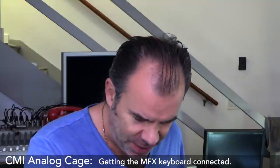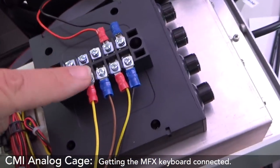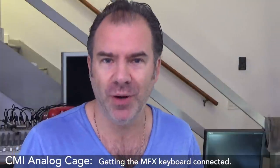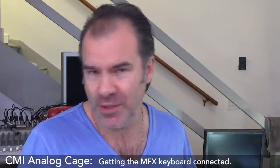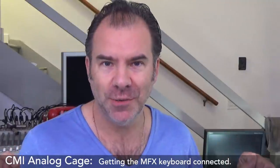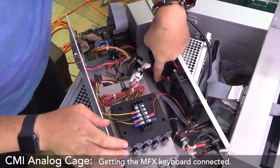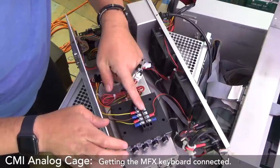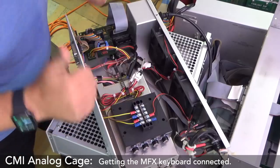But I see that there's a power supply that comes up here. I can tap into this little terminal block here, and then from there, it can go on its merry way to wherever it was going. I'll take another tap off of there and power the 354 card. Peter Buck tells me that this card, if it just gets 5 volts, it should be fine, because it's just driving 7400 logic, so it should be okay. All right, let's do it. So what I'm gonna do is I'm gonna clip off these things. I'm gonna cut it about here, and then I'm going to route it here. Then I'm gonna unclip all of these little things and then make it go that way. Boom.